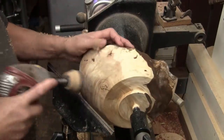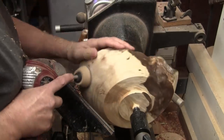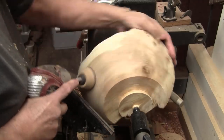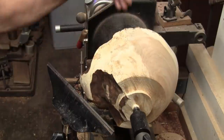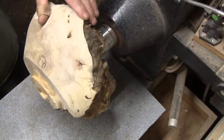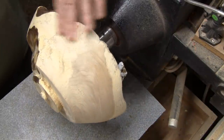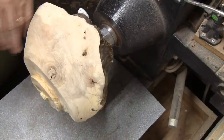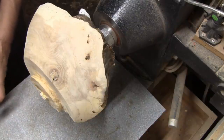Not all that good, so we're going to be doing this a lot. We'll see you when it's ready to put finish on it or flip it around. I have it all sanded to 400 and there are some areas that just don't want to sand out so well. It's kind of punky here, so I'm going to put some sanding sealer on it and then sand it again. I'm going to use the Zinsser Seal Coat for the sanding sealer.